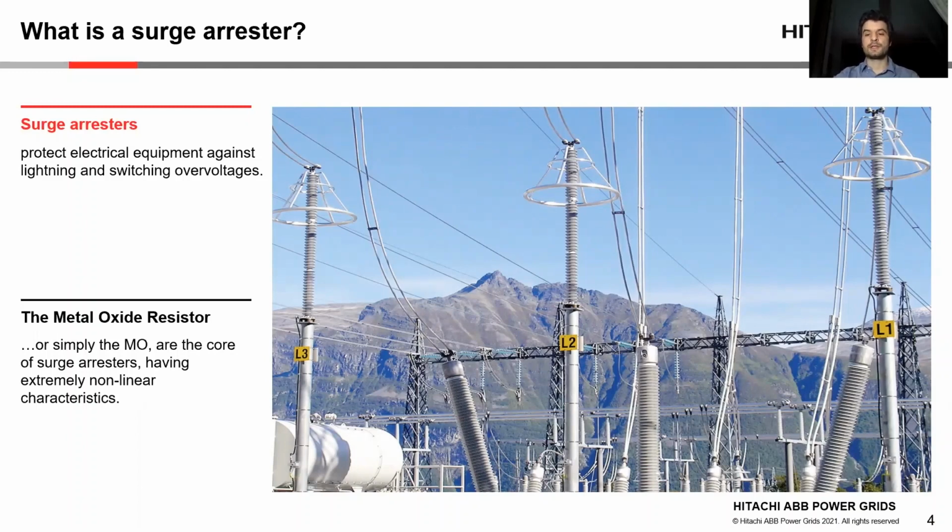Measuring the surges and their intensity provides useful information about the electrical network and its overvoltage stress due to atmospheric discharges and switching overvoltages. Additionally, the measuring of the leakage current through the surge arrestor provides important information regarding the condition of the surge arrestor. There are several devices in the market providing such information, none of which, though, utilizes LoRa communication and is fully wireless.